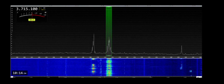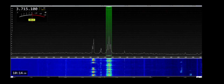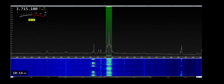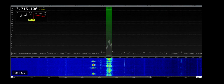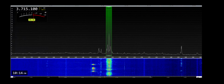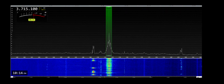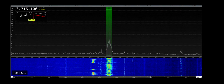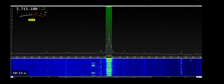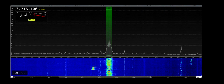But I guess the other issue that might have been handy was amplifiers back then were all screen tubes, so they only took 4 or 5 watts to drive them to 1,000 watts in. So that was maybe a little problematic too. So I'm sure they had their issues with not putting in screen control power out, but probably the bottom line is the number of people actually utilizing it versus the cost of putting in a pot. So that's a couple things I thought about.